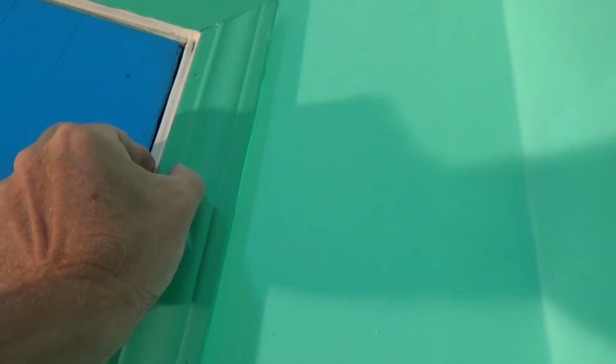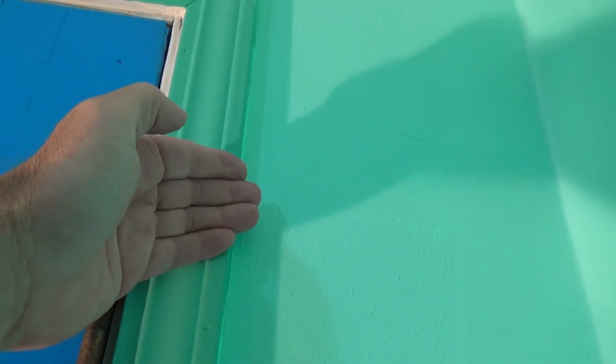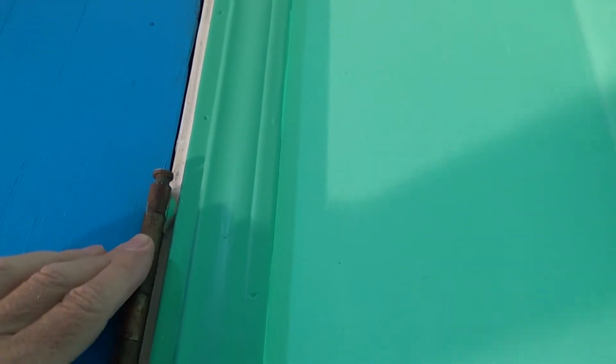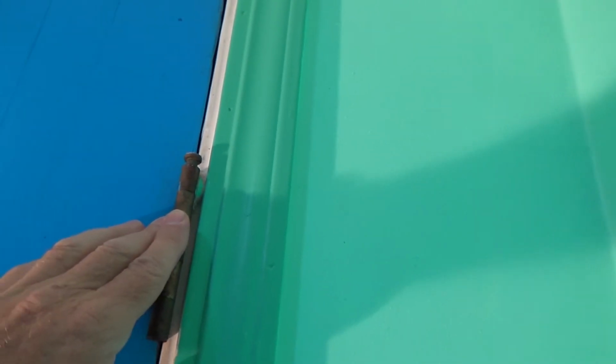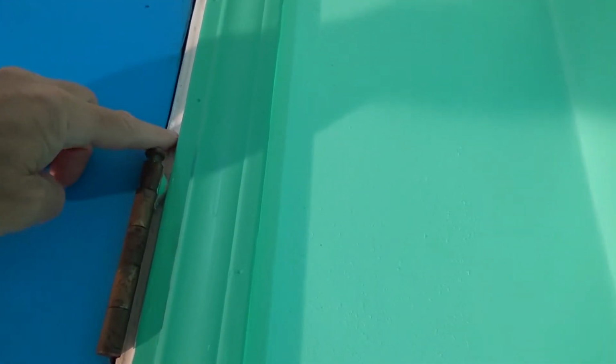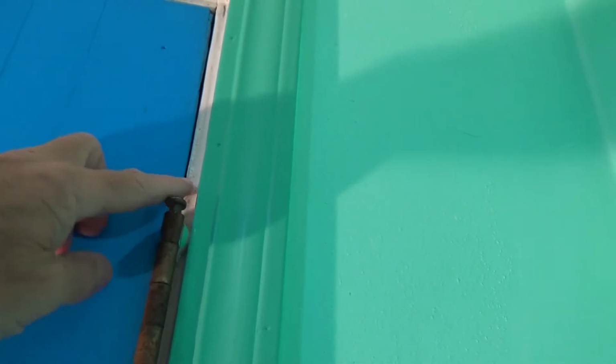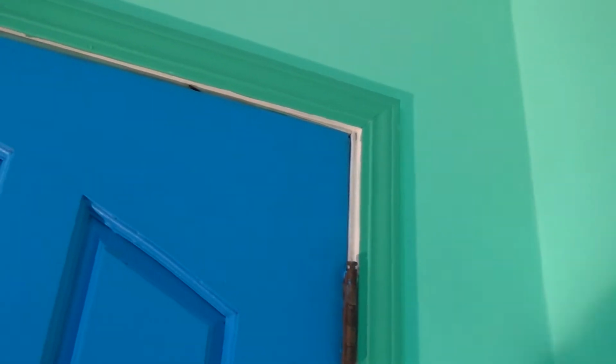And this door jamb is 3/4 of an inch thick. And then there's some shims behind there, and then they attach that to the 2x4 supporting member. It's called a king stud, and that supports your door over here. Now I'm hoping, you know, I'm not going to take this trim off. First off, I'm hoping I can take this and suck it over a little bit at the top here. And I'll show you that in a minute, okay?